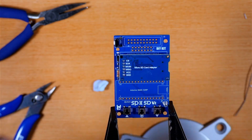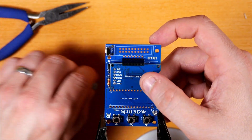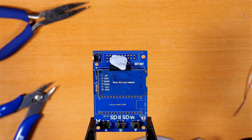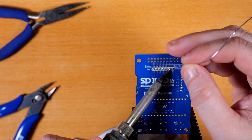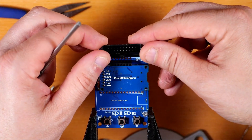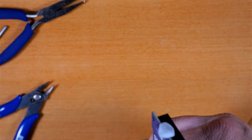Use a little more blue tack to hold the SD card module in place while you flip things over and solder, then trim the excess. Next stick in the 7-pin header for the OLED display — important note: use the lower set of pins, not the upper ones right next to each other. The upper pins are only used if you're using a large 2.42-inch OLED display with reversed pins. After securing it, lean it over and solder the pins. Next put the IDC20 connector on — pay attention to the orientation of the notch to match the PCB.